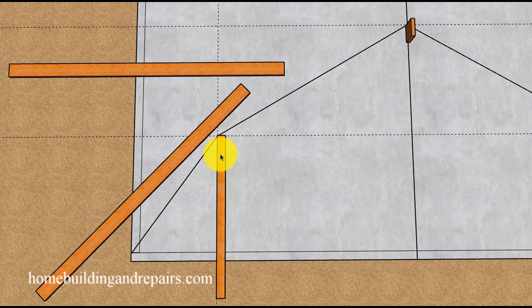This is the kind of stuff that can be confusing — if you put the wall on the wrong side of the line when laying out your roof rafters, you're going to have a problem. So lay out and mark anything that you think is going to help you figure out the roof rafters along with the wall framing height.